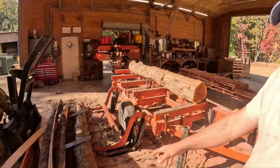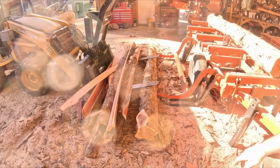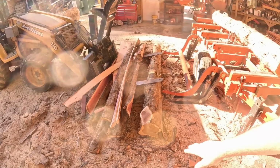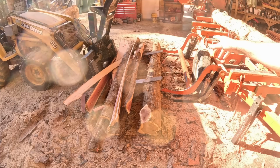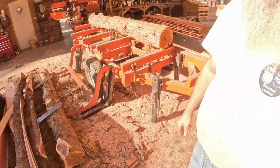This on the ground is kind of a more typical treetop cedar. About 8 inches, maybe 10 at the widest point here. And you're lucky on the other end if you get 5 or 6. And that's what you're going to find when you start getting up to the top of a cedar. There'll be a tremendous amount of taper. And you can either square it up, make a 4x4, 5x5, or in this case, I'll probably live edge a lot of it just to keep from throwing it away.